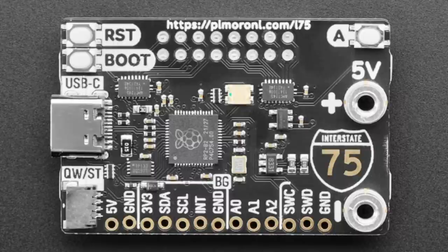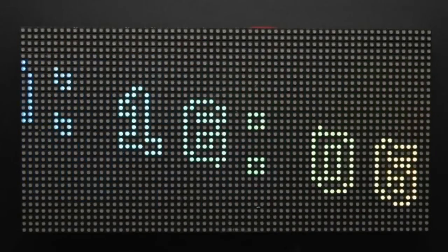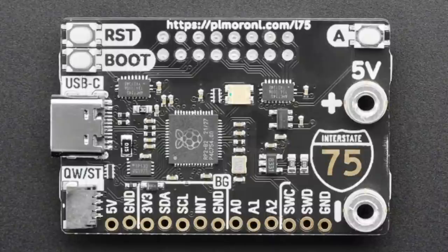And inside there, you can see there's an RP2040. It looks like about 2 megabytes of flash memory. StemmaQT quick connector. It's got an RGB LED just for indication, level shifters, reset and boot switches, and debug port stuff. It's an RP2040. Can it run CircuitPython?